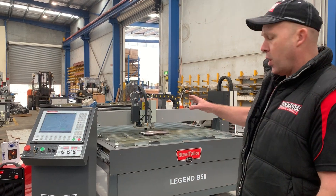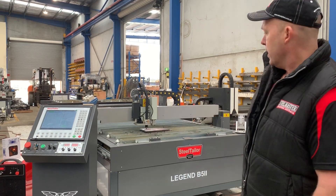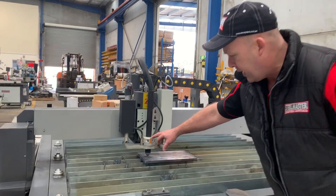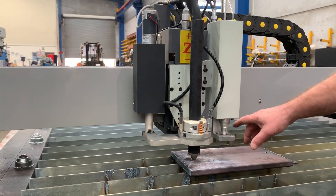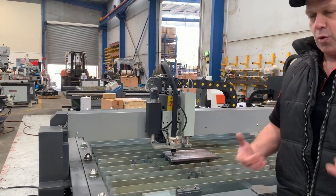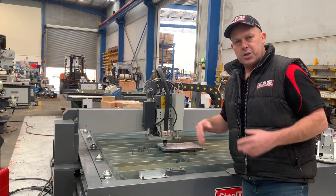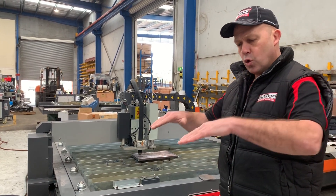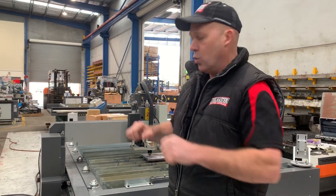The particular size of the pocket table here is a 1.5 by 3 meter table, heavy duty gantry type. We've got the standard plasma cutting head with the torch fitted there, and we've got the etching engraving head, which is fantastic for fold lines, bend lines, general marking, engraving, etc. The black box over here is your THC — your torch height control — which basically controls your torch up and down, maintaining arc voltage all the way across, even over a corrugated sheet.